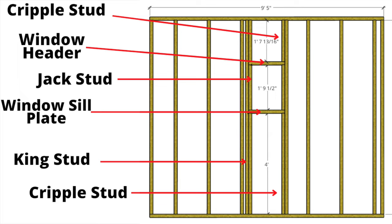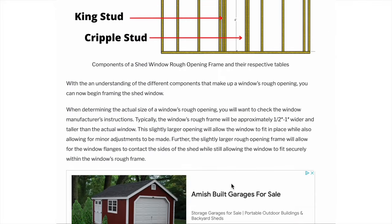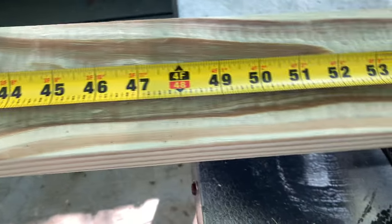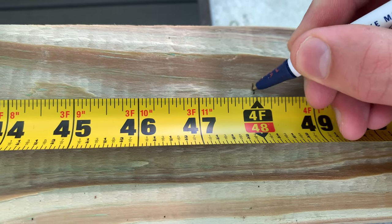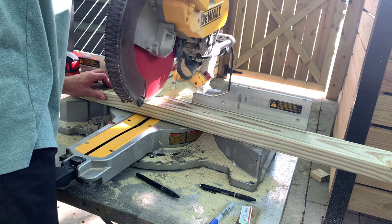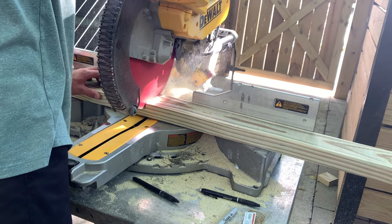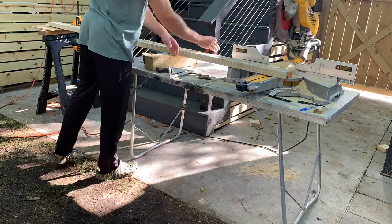As you can see, that consists of cripple studs, king studs, the window sill plates, jack studs, the window header, all that stuff. So refer to the course material for that. And I'll also link one of my blogs in the description, which goes over the shed window framing process step by step. Okay, so at this point, we're going to go ahead and mark our 4 feet to frame in our windows. And this 4 feet marking is for the cripple studs at the bottom of the window that are going to support the sill plate. So I'm cutting 2 for the first sidewall, and then I'll cut another 2 4-foot cripple studs for the second sidewall.